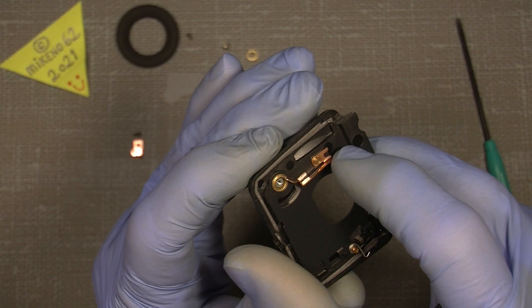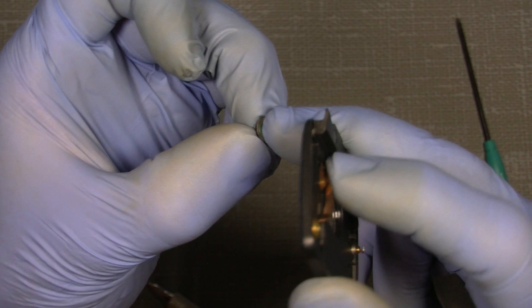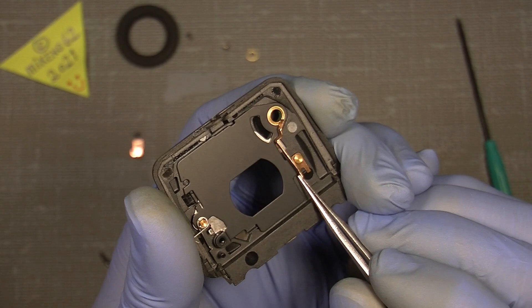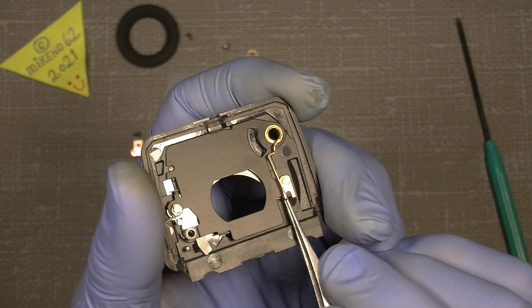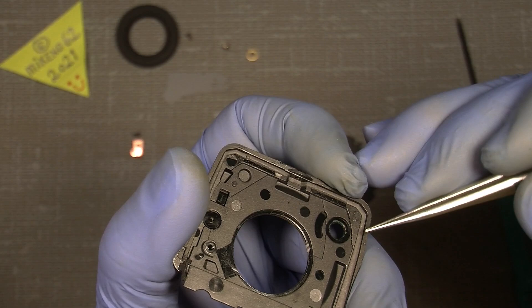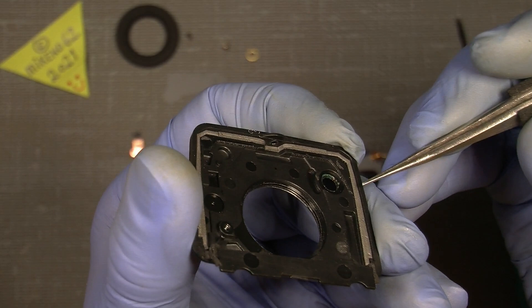Put it down here so we know where it is. The little spring comes off, and now we should be able to push the lever axle out so it will come out to the back. Have a finger in here - you'll probably see there's really old grease, and it's actually green, so I think there's been water in here at some point. Flip it over and take the whole assembly - the rest of it out. It's kind of an axle here so I can just lift it up and flip it over.